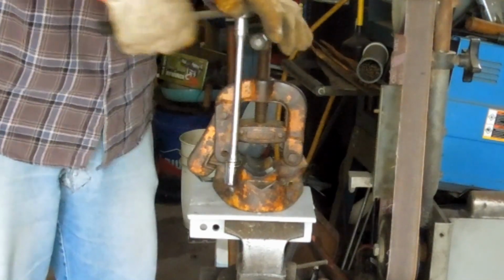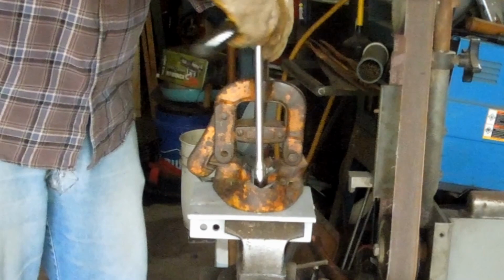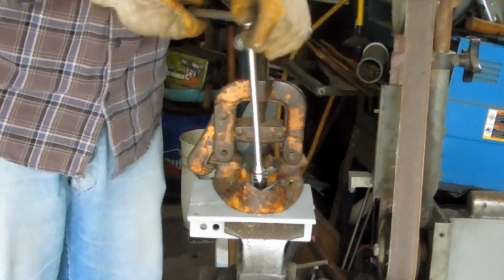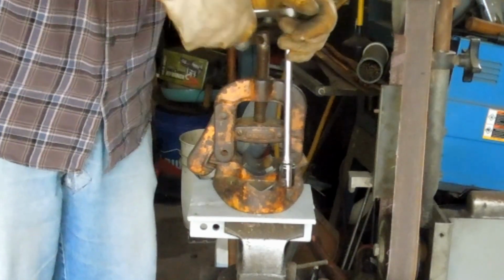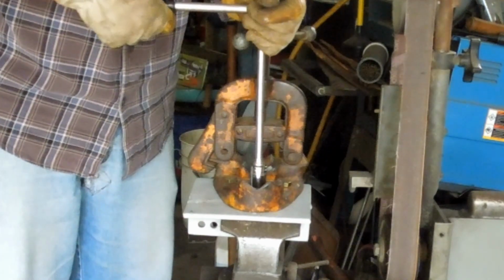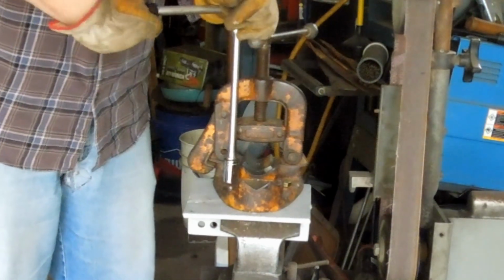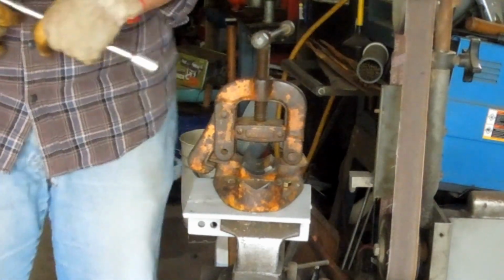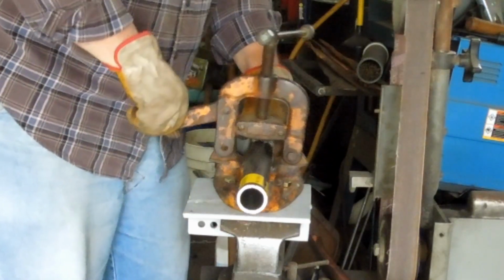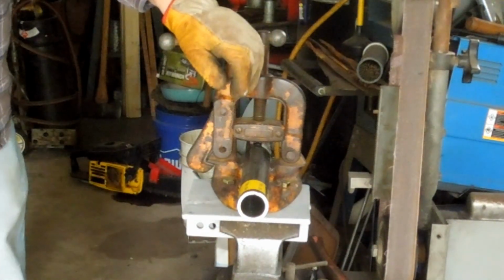And you have 3 bolts that are in the holes that are very, very closely oriented. It's always best to just start them all by hand first. Make sure you get 2 or 3 threads engaged before you start tightening anything down. Because otherwise what's going to happen is you're going to get the thing tightened down on one, and then you're going to just have to loosen it up to get the other one started. There. Nice and solid. And that's going to work pretty darn good.